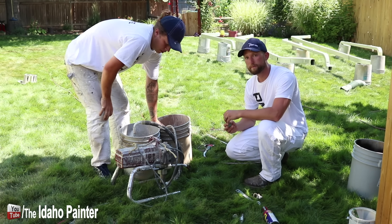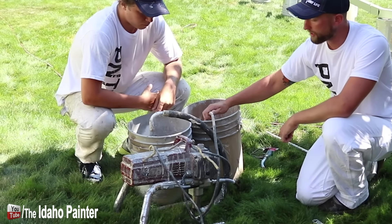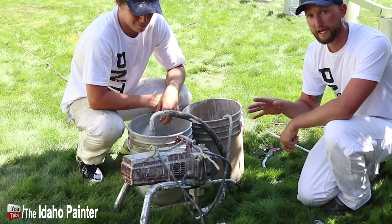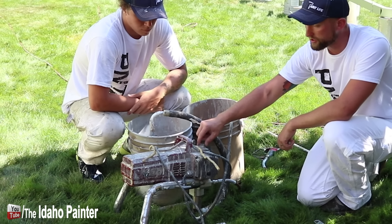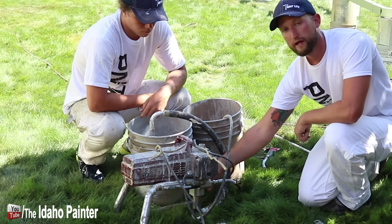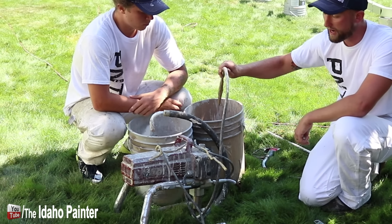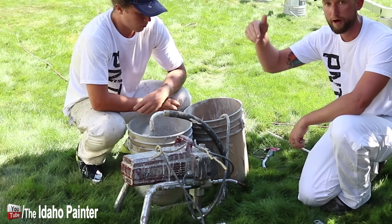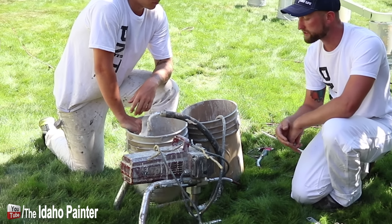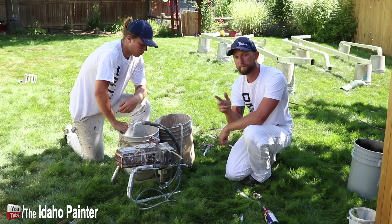If you've never used an airless sprayer before, here's what you've got: this is your siphon, and this is your prime hose — the little hose that comes out next to the siphon, which is the big one. Most sprayers are going to follow the same pattern and they're going to be pretty simple. You're going to have your pressure dial, which brings your pressure up or down. There's a little prime valve on the backside that's going to make it so that it either sends fluid through the prime hose or to the gun. If it's pointed down alongside the prime hose, that's going to be prime; when you click it up, that's going to be spray. And then you've got your power. Really you've only got three things to worry about: power, your pressure knob, and your prime valve.